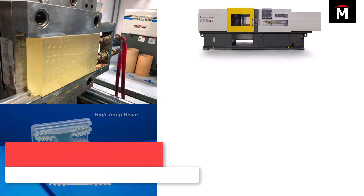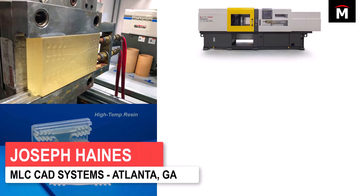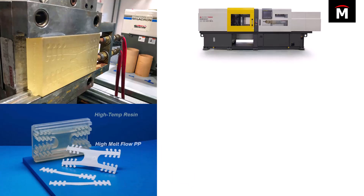This was their setup. They used a medium-sized injection mold machine — a Cincinnati Milacron RoboShot — and they printed their molds using high temp resin. They only had to print one half because these mask straps are flat, and the other half is just a steel plate that abuts against the high temp resin mold. The actual injection shot material is a low viscosity polypropylene, also called high melt flow — it's so low viscosity it flows almost like water.